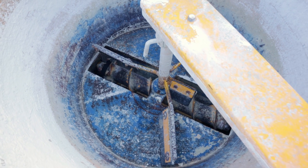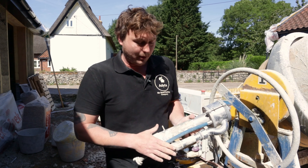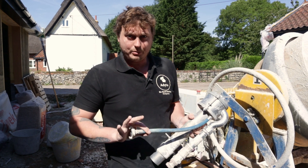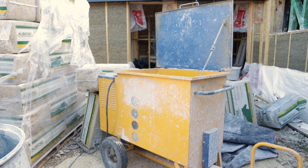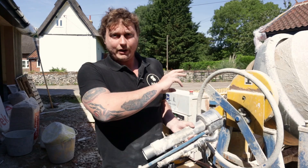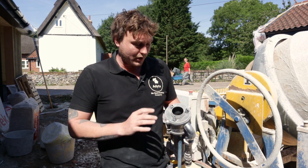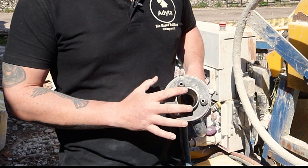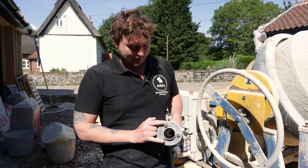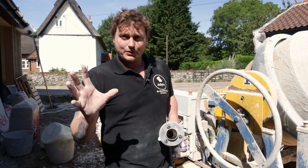We have binder fired out of our spray machine on a high pressure pump, comes through this nice big black cable, up to our lance end, and meets in this chamber with high pressure air also fired out of the spray machine. We also have our hemp box over there with its Archimedes screw and a beefed up leaf blower firing hemp down the pipe into this main tube. The hemp comes straight out here, a bit like throwing confetti but with more force, and our binder and air mixture gets fired out and they all meet in mid-air in front of the wall, then stick to wherever we're firing.